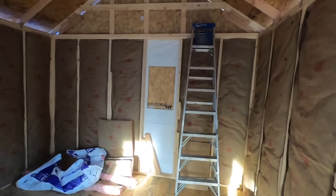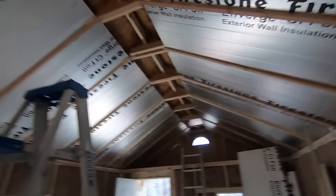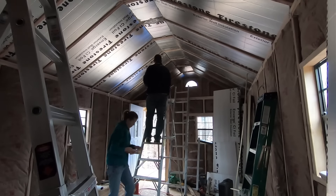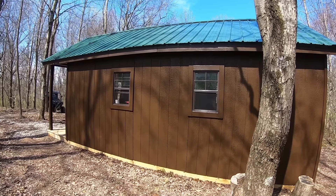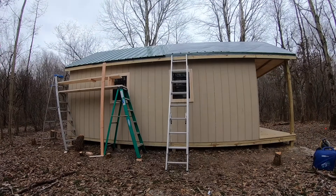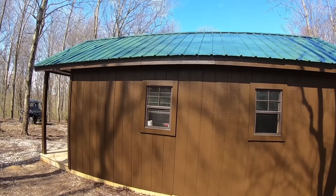Some of the materials I used in the walls: we used traditional batt insulation, paper-faced. In the ceiling we used poly-iso hard foam insulation and I got a good deal on this at a local Amish building supply company where they had a lot of overstock — about half the price you'd pay at a big box store. I had very limited room to work in the roof rafters because there were only two by fours, so I had to come up with the best insulation I could. The metal roof I also bought at our local Amish building supply store — I just bought the materials and did it myself and I'm pleased with how it turned out.